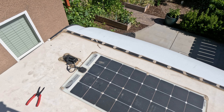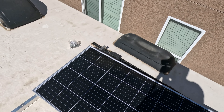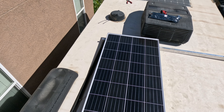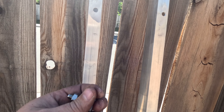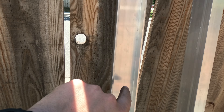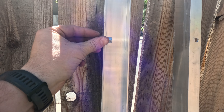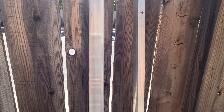We're going to go outside now. I'm going to show you my whole setup out there and then we're going to start putting panels on the roof. You can see here what I had — I went ahead and disconnected that. This was a Rhino roof rack that was up here, and now those crossbars are going to go in and I'm going to screw them into place. It's just a sliding T-slot and these go in there and lock into place. I have my mounting holes up here that I drilled in the C-channel. I went with C-channel because I can access it on both sides — it mounts on the roof side and the panels bolt through here through the frame of the panel itself. Pretty simple.